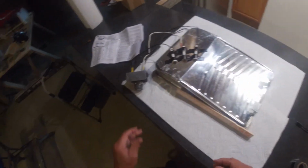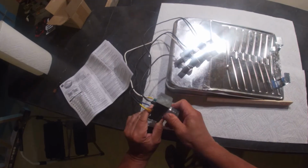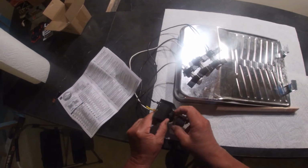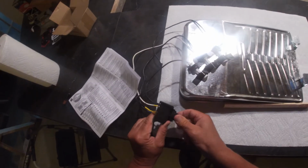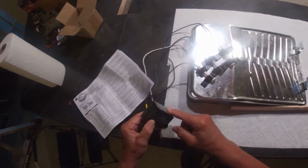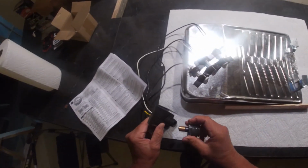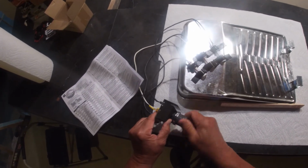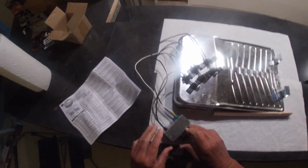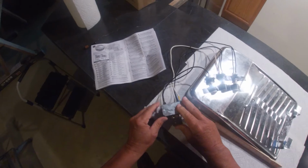In addition, it's important for you to note that I positioned the igniter box away from the metal tray. The Weber igniter actually attaches to its metal chassis with this nylon plastic lug nut here, so this part of the igniter does not make contact with the grill's metal chassis, which would short out the negative ground connection. This insulating design ensures that you, as a grill operator, cannot be shocked with the igniter's small electrical charge when pressing the igniter button.